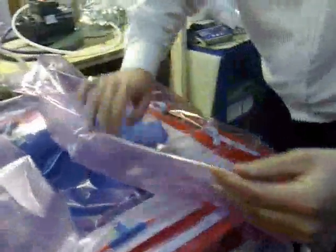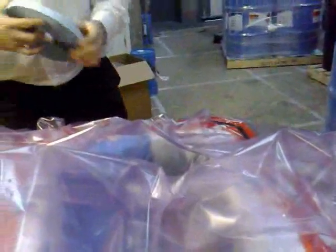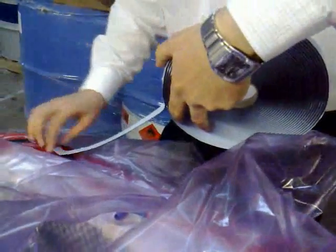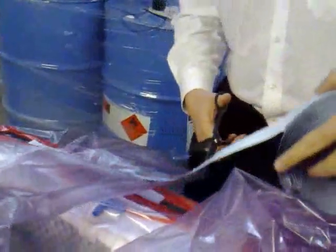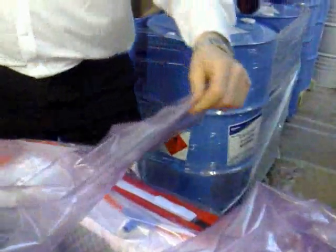For most things in life there's an easy way and a hard way of doing these. The easiest way I've found is if you take your pleat, fold it down flat, and then lay a piece of sealant tape extending about an inch past the pleat space up to the top. And then just cut it about an inch from the top as well. Then you can pull that off the bag.